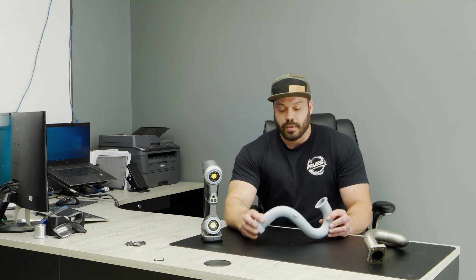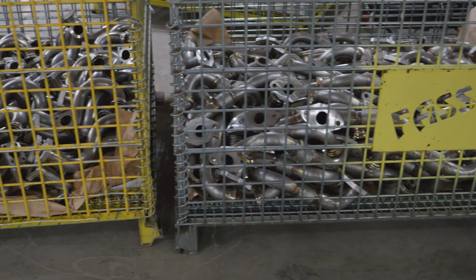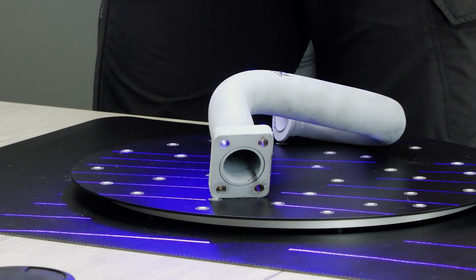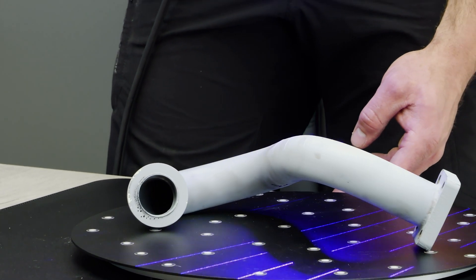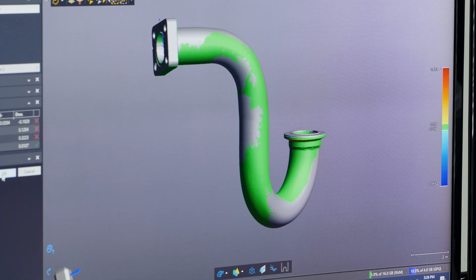No doubt. Then we can see where the different tolerances are, because this is bent tubing — there are tolerances even though we have very low tolerances. I just took our quality control part and the part that we scanned, merged them together so it basically looks like one, and then we can go in and measure the differences. This is the two tubes laid over each other, and the color map will show the differences.